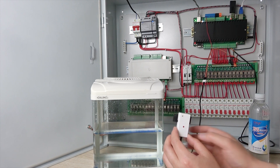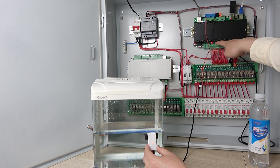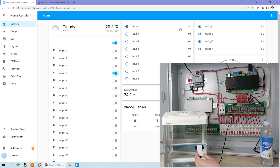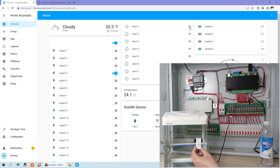When you use this sensor, you just stick it on the water tank. You can see the red indicator. I have created the automation so that relay 4 — output 4 — is triggered. You can see in Home Assistant: input 1 is on, and relay 4 is on. I can move this operation. When I move it away from water it goes off, and when I move it to the water it turns on. So this water sensor can detect water in the tank.